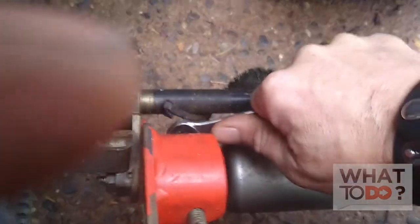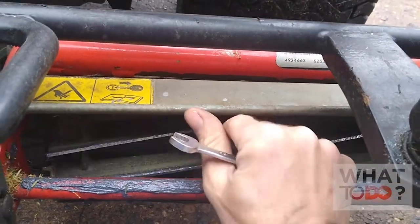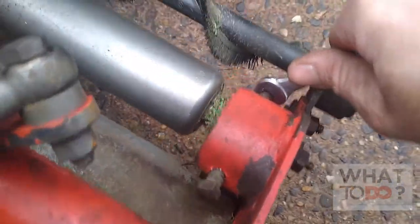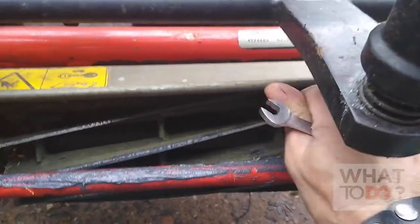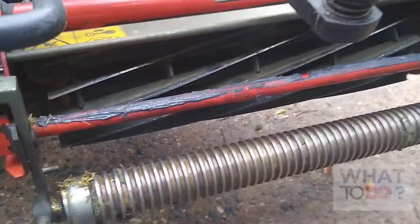Get the bottom bolt, loosen it to the right, then on the top go to the right to tighten it — you can kind of hear it by hand. Be careful sticking your fingers in there. We still don't have contact, so repeat this process on both sides until you get contact. There we go — now I get a nice contact. When I start this up, this reel is going to be screaming, but it's not too tight — it's just enough contact to get those blades nicely back lapped.